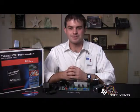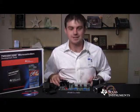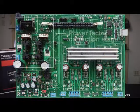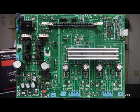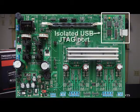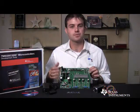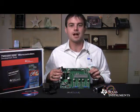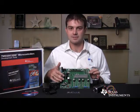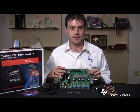Let's take a closer look at what's included in the kit. The first and key part is the motor control baseboard, which features a power factor correction stage and two motor driver stages, as well as an isolated USB JTAG port. The power factor correction stage takes 10 to 14 volts of AC input and outputs up to 24 volts of regulated DC output, actively controlled by the Piccolo microcontroller and capable of outputting up to 100 watts of power.